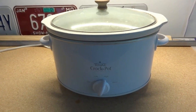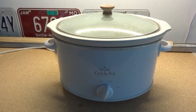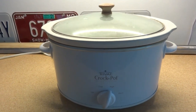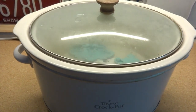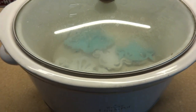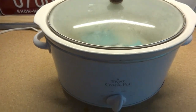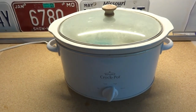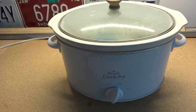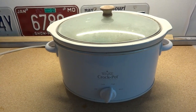I notice it probably takes at least five, six, seven hours — you'll notice it start getting soft. Basically you can just start working on the rest of the furniture project and let these just boil the paint off. What happens is it'll eventually get soft enough, the water basically boiling. Just grab a pair of pliers, pull one out, and you should be able to take your fingernail to it and it'll just strip off real easy. Let them go for five, six hours and check them — the paint will come off real easy.